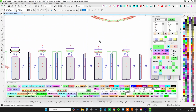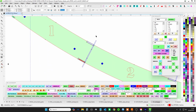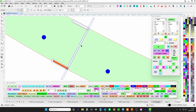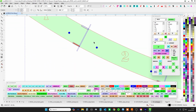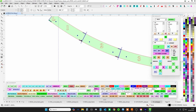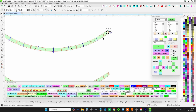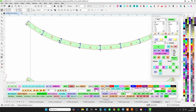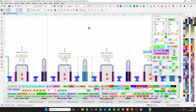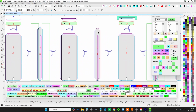Then you're going to be riveting the verticals, and the idea is these green guys are going to smash the verticals in place. So this bearing edge and this bearing edge, once you rivet them together, this green guy is going to force the curve. And don't worry about the ends yet. Don't worry about the ends. The verticals on the ends stay off. So go ahead and rivet this system together of flat jiggies that force the smile when you rivet all of these together. So rivet the verts.